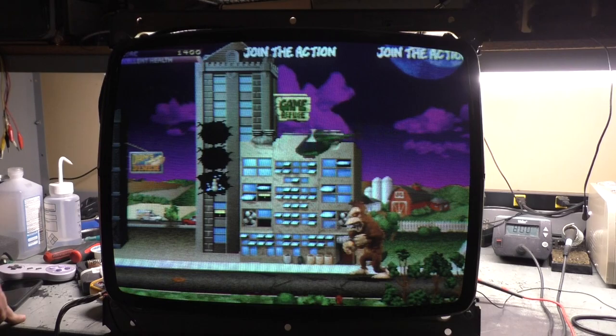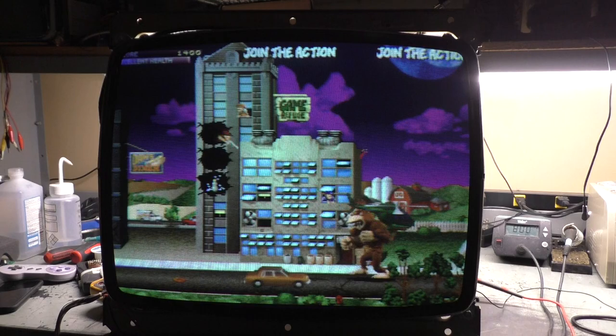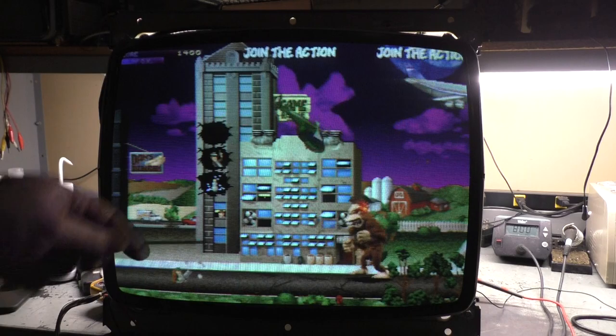there you go, ladies and gentlemen. A repaired K7400. I just simply had bad caps, maybe a couple bad solder joints, but I don't think so. I think our vertical hold problem was caps. Nice full reflow and rebuild, and it's good to go. Of course, I need to leave it on for a while and make sure that we don't have any brightness drift or focus drift where it needs a new flyback.